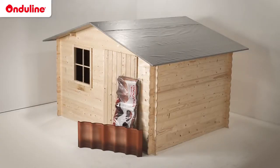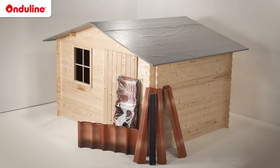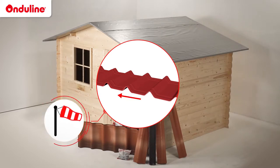In addition to the tiles, Onduline also provides verge pieces for the sidewalls, slim caps for the ridge, closure caps for the ridge ends, foam filters for the eaves, and Onduline fasteners. The installation of these elements is always done in the opposite direction to the prevailing winds.